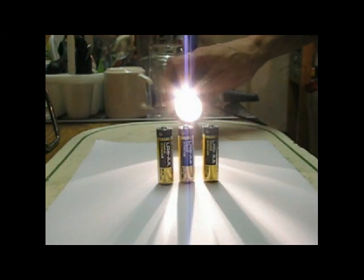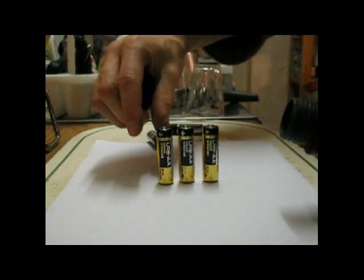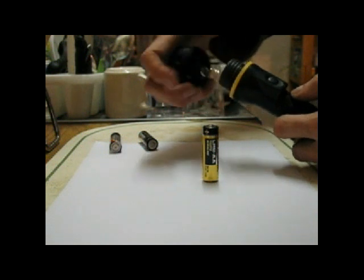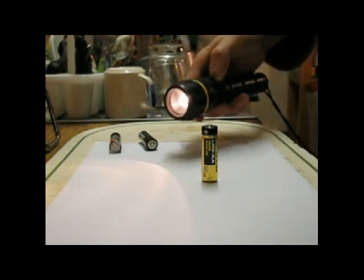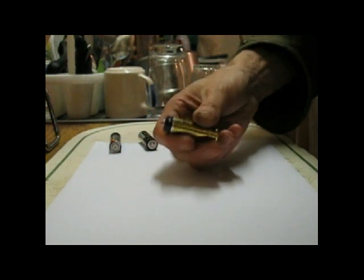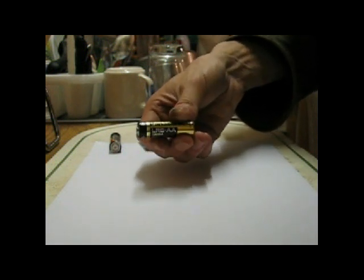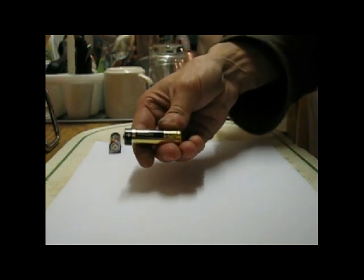Here's my torch — I'll take the batteries out. Two of these were completely flat about five hours ago, and there you go, good to go. So instead of throwing out your AA alkaline batteries, you can charge them up — but only for an hour at a time, three to five times maximum. You must not put them on charge and then go away and forget about them, because they will leak, might explode, and if they short circuit they could damage your charger.